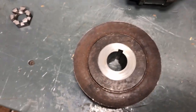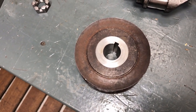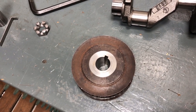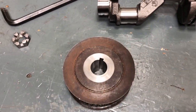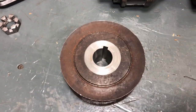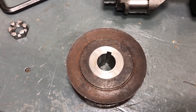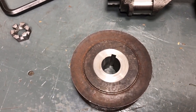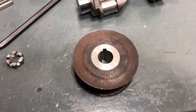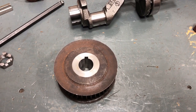I don't know what torque this compressor requires to drive it. The crankshaft looks similar in size to the one in my shop compressor, which is a five horsepower compressor running at 750 RPM crank speed. To be conservative, assume maybe this is a 20 horsepower compressor — four times mine — running at 750 RPM. That comes out to 140 foot-pounds of torque, which is 1/17th of what I've calculated this can hold. So using those numbers I'd have a factor of safety of about 17 to one. Even if my calculations are out quite a bit based on the assumptions, it should still be more than strong enough for the job.